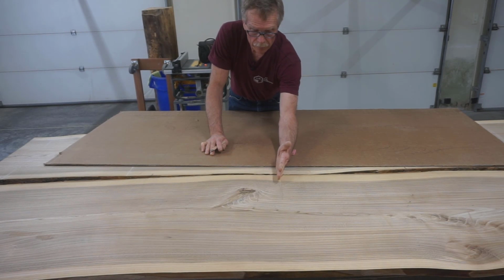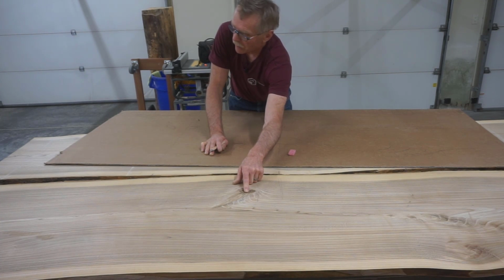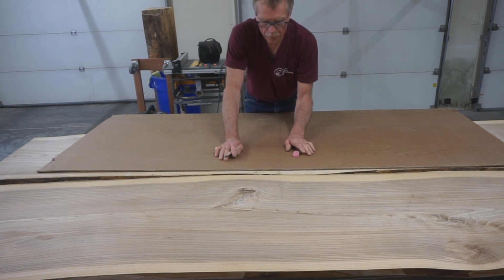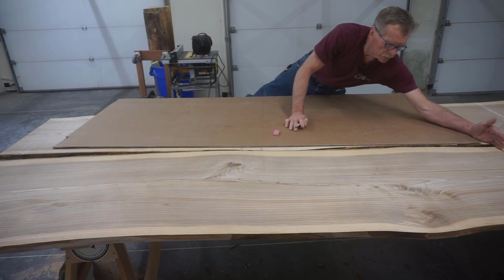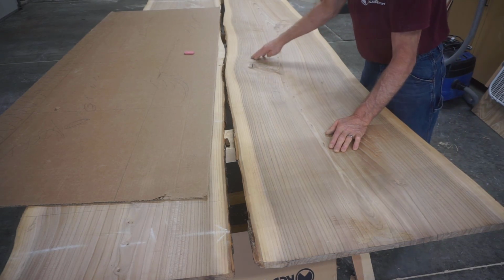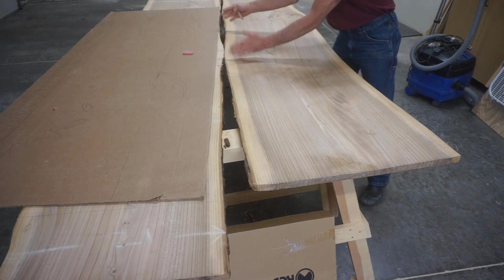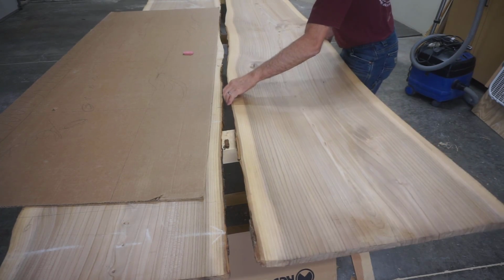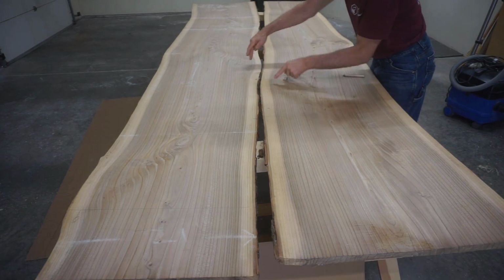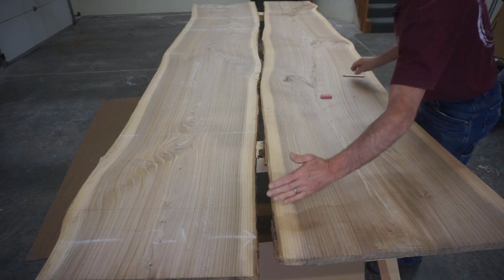But I want to keep from cutting the slab right next to that feature because I'm not comfortable with the instability I get there. So I can only go so far that way. And I'm going through all this discussion to determine where to cut this top slab for length. I'd like this knot to be as close to the door center as possible, and I don't have enough slab length here to push this knot clear over into the next door panel. And I think I decided on a sweet spot, right about there, for the cut between the center doors. That will help these two dips and these two bumps line up, and cuts for other doors will be more workable. I'll determine the exact final position of the two slabs when I get back to the shop.